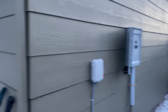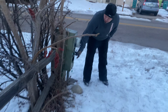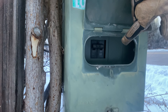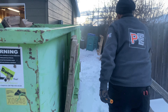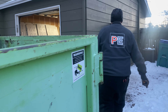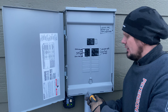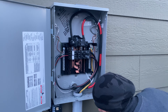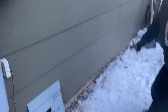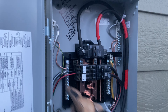Down here the meter stayed. It's going to be hard to find that breaker for him. I did have to get it approved, and I showed that it was a 1-ought wire coming up that could support 125 amps. I had to take pictures and send them to the power company, and then they came out and checked the feeder size. I also checked with the building inspector. Once that's all in, we had to drive two 8-foot ground rods, an inter-system bonding bridge bar for their new fiber optic, and seal going through the nipple. Everything is bonded appropriately.